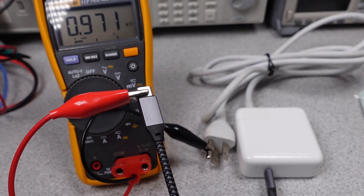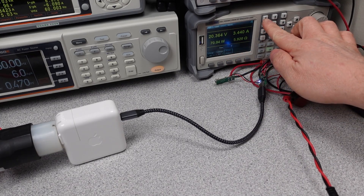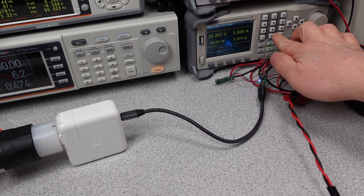In terms of modes of operation and specifications, this power adapter has a lot fewer modes of operation — it is clearly made for what Apple needs. The adapter does over-specify the 20-volt mode as 20.4 volts, which is a little odd, but obviously it's what they needed. There is no 12-volt mode. The adapter cuts out at an overload level of about 78 watts, which is a safe limit in case of any damage to your USB cord — the power adapter itself should be tolerant of a fault condition.